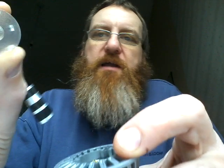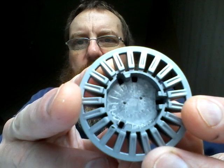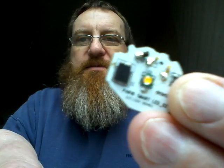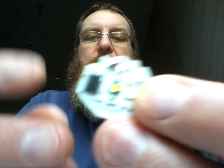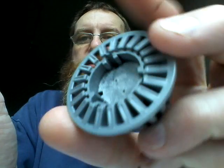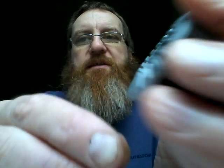Let's pop the lid off this. I've had this open already, and so the way it's assembled is quite pleasing. The cap physically pops off the front — the lens. So it's a little plastic frame with the lensing system in it, and inside is a circuit board which I've just dropped out, because I had removed it earlier and it did have heat sink compound in the back of it. So the circuit board has this single little chip in the middle. That's not going to handle 5 watts very well. The circuit board's an interesting shape that fits quite snugly into this housing, which is actually aluminium. It feels strangely plastic on the outside — I'm guessing they just sprayed it with a finish.